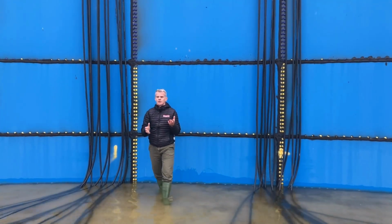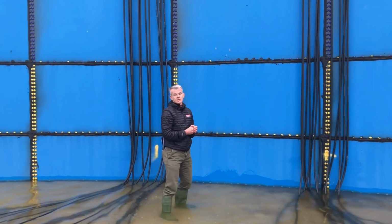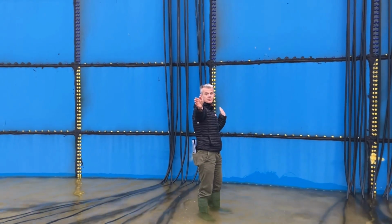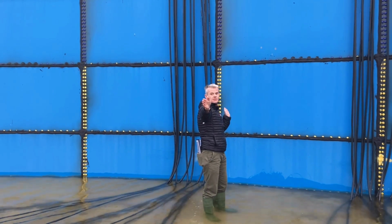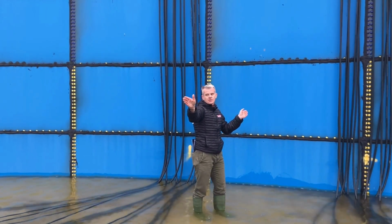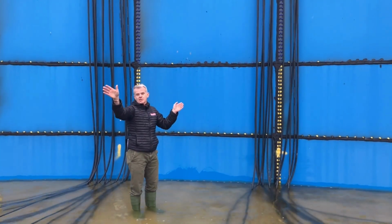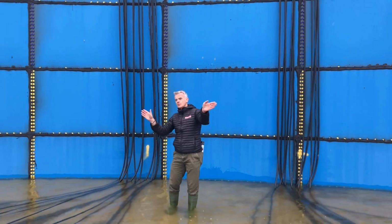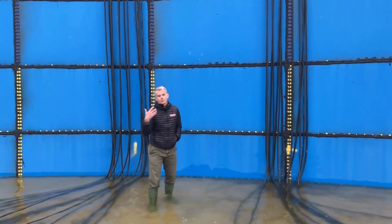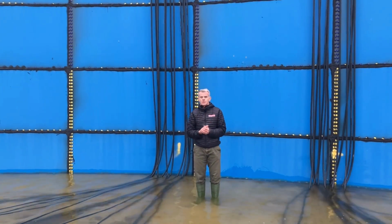As a rule, and in this instance, the diffusers will work, let's say, at 12 o'clock, 6 o'clock at one given time, 10 to 15 minutes, and then 1 o'clock, 7 o'clock, 10 to 15 minutes, and 2 o'clock, 8 o'clock, for 10 to 15 minutes, and that sequence will continue around until we've gone right the way around the tank, and they'll be repeated generally twice a day just to keep the slurry moving and liquid.